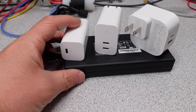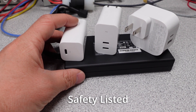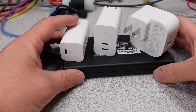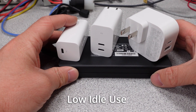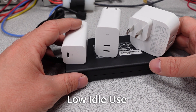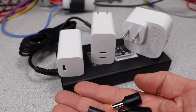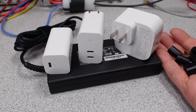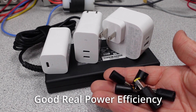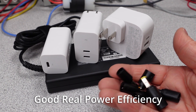The positives: these adapters all have safety listings for various markets. The US and Canada safety listings are split between TUV Rhineland and Underwriters Laboratory. The idle power consumption on these adapters is amazing — the extremely low idle power consumption and clean power makes them stand out among most of the lower power market competition. These adapters all have the DOE 6 mark for the 115-volt market, and all of them met that efficiency and idle requirement with ease. The real power efficiency of the USB adapters is very high, and the laptop adapter is good.